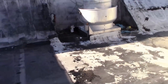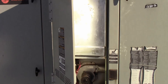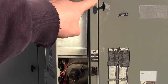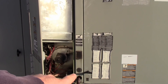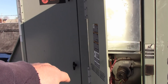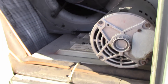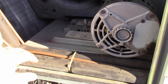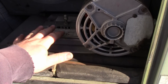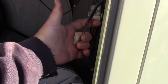Now we've got to remove it - the new one is on its way. Unlike a lot of other units, these are kind of a pain in the butt. This panel here has to come off, and this panel here where the hinges are has to come off. Unlike a Lennox or a Carrier, this motor has to be disconnected and they don't give you a clip for it.